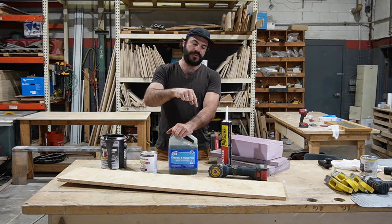The last thing to all of this is that if you do decide to insulate the floor of your bus, and I would encourage everyone to do that, if you use an insulation like this here, this is designed to be buried, submerged in dirt and mud, and will not degrade. So as a part of our flooring system, we leave those holes because we're not worried about them, since the next layer down is going to be foam board, to varying degrees of thickness, and gluing that foam board down will be our polyurethane adhesive. So you have two things that are totally impervious and don't care about water, sealing that all up.